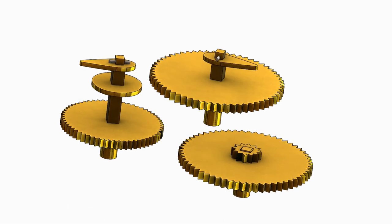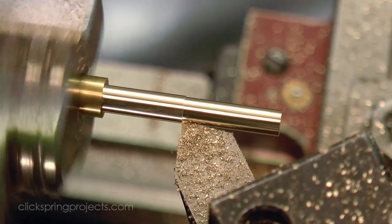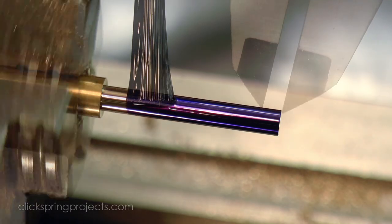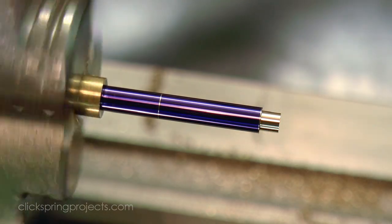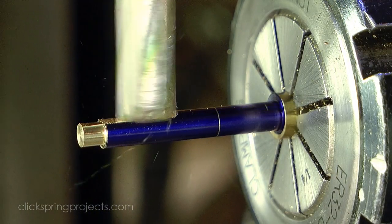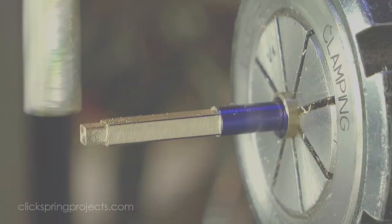Next up are the O, P and Q assemblies. The O assembly is present in the wreckage, so there's a bit of guidance about how this part of the mechanism was put together. But the P and Q assemblies are absent, so I've reconstructed them along similar lines to the O assembly. I used the lathe and mill to form the basic arbor profiles, taking light cuts due to the extent of the work overhang. And then I used needle files to bring them to final dimension.